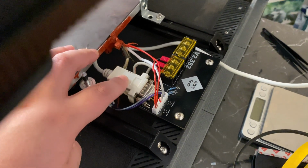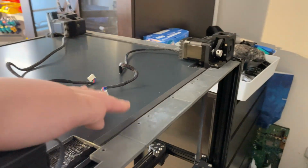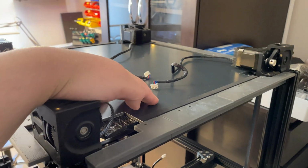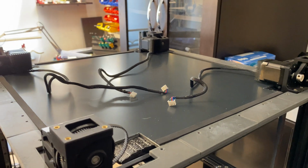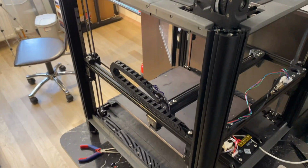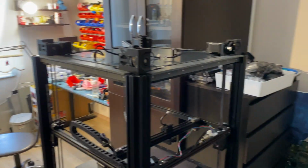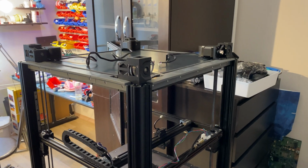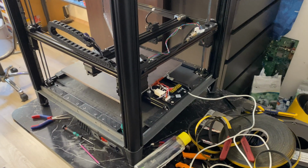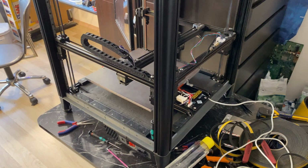And this, which is a DB9 connector, will run through this cable up to here, where we will have the breakout PCB, and from that it will break out to the control boards. But that's going to be it for this episode. I think I did as much as I can. Today is Friday morning, so not much more I can do. I don't want to upload this video a few hours late like I did last time.